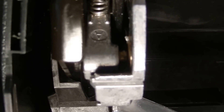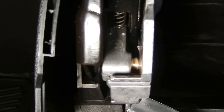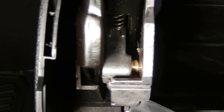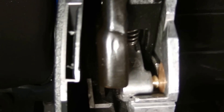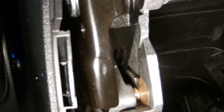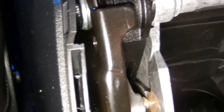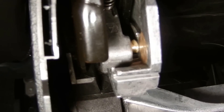Put a couple of springs in. There's a spring inside that I use to hold the ratchet down, and a spring inside the little lever arm where the pin is to hold it against the plate. The lever arm is held down against the ratchet, and as you pull it up it clicks into each position, being held down by that main spring.